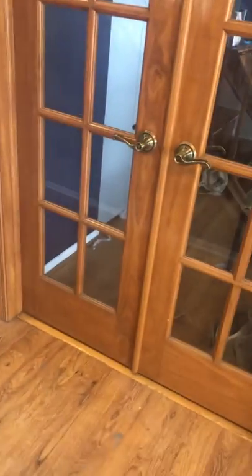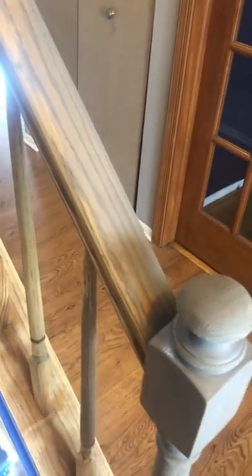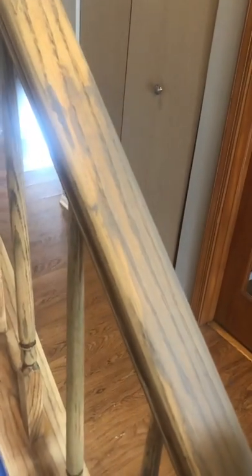After you let this sit for a while, you take another sock — a different one that's clean and not full of stain — and you kind of rub this stuff out of the wood. You'll see it'll eventually soak in there. If you want a cleaner, silkier finish, we can add some varnish, which Mr. Pfeiffer will do as another step another day. And that is how you start to stain your mantle or any piece of wood so that eventually it looks kind of like that.